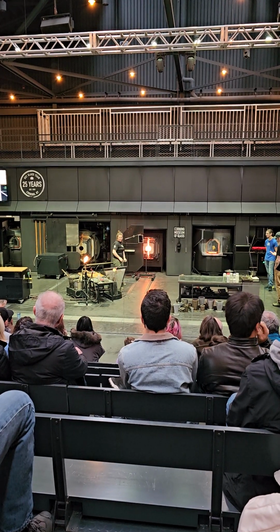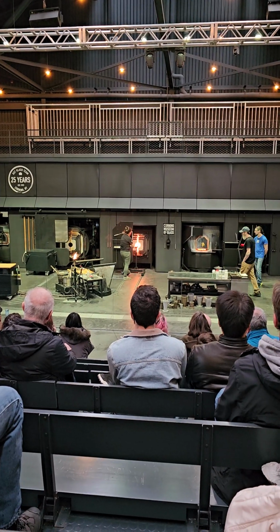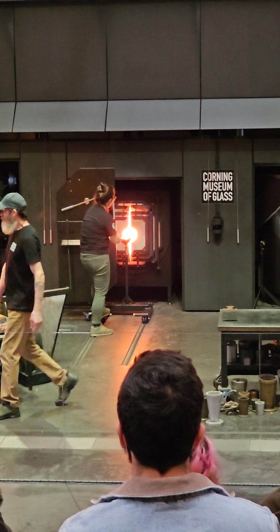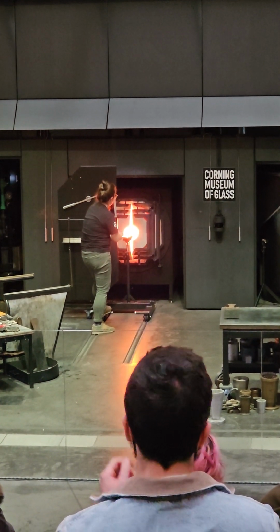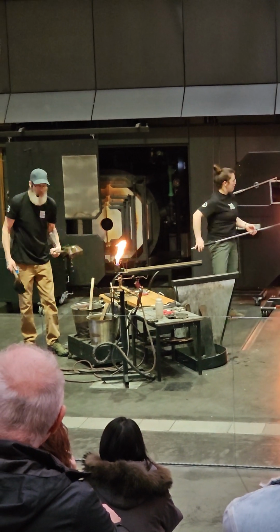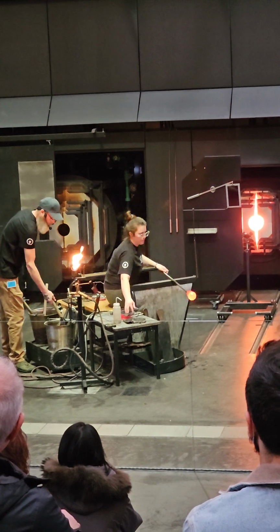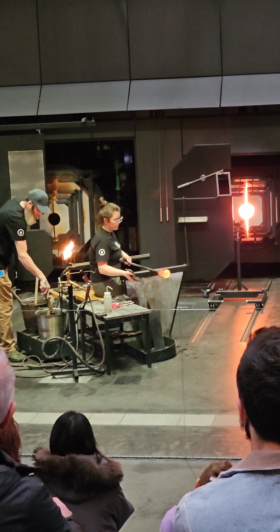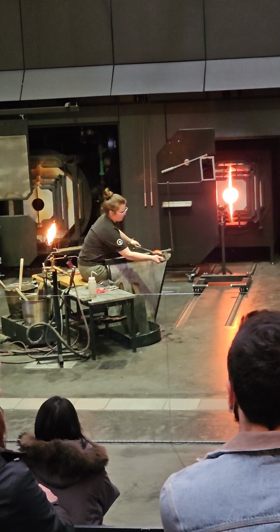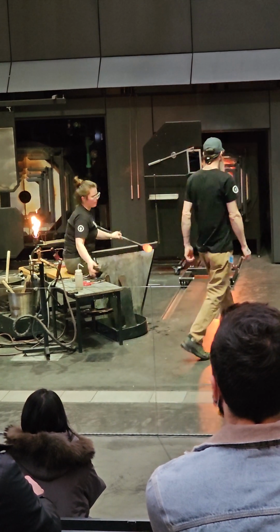First thing any glass blower will do when they take a gather is they roll it into these wooden tools sitting behind her bench in these buckets of water. We call them blocks. Just like a big soup spoon made out of fruit wood. Now, in different sizes, the more glass we get, the larger the block. They're soaked in water continuously. They're made out of fruit wood because the grain structure is really tight, so they burn out nice and evenly. As well as there's no pitch or sap in there to steam off and stick to her glass.